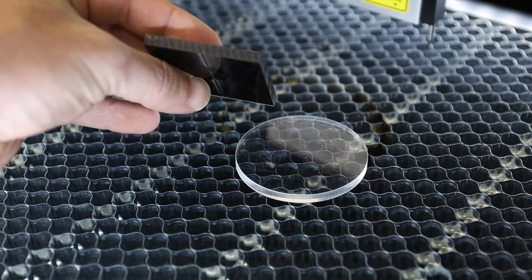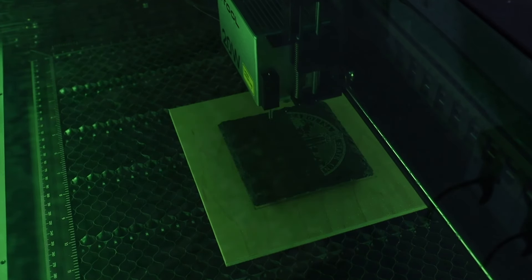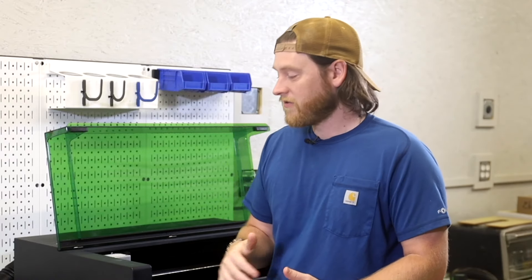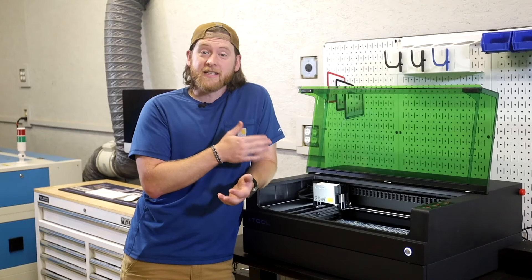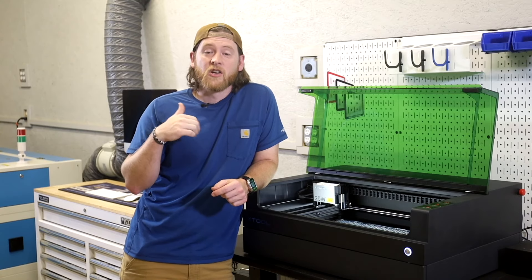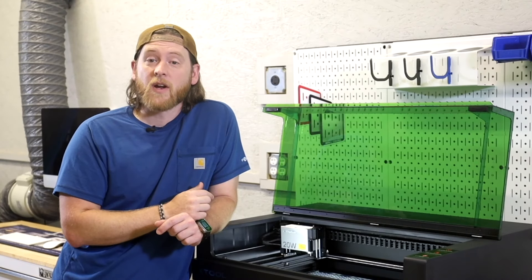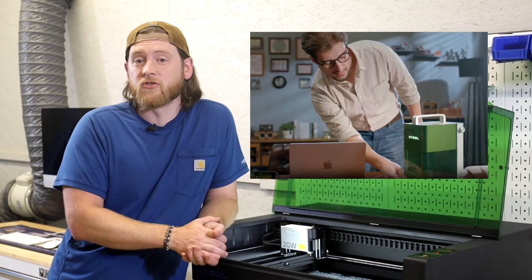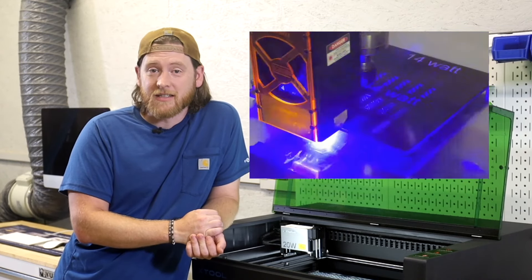Dark colored acrylics I can cut fine, and other things like woods and MDFs of course. A diode laser does a much better job of doing some high-detail work like photo engraving. These units run much slower than a CO2 and have much less power, but when it comes to high-quality detail work, a diode laser can sometimes be superior. These lasers can cut some very thin steel where I would not attempt that on the CO2 laser. They can range in size and come in a very small footprint, like desktop models or even portable lasers, and can even mount on a CNC machine.